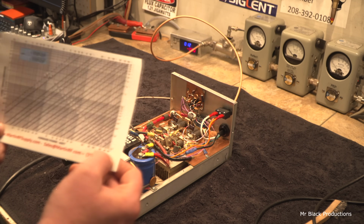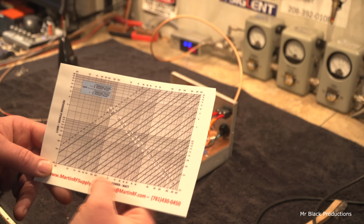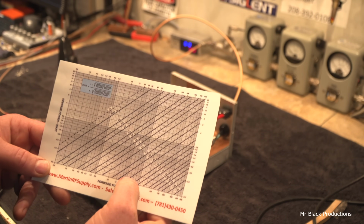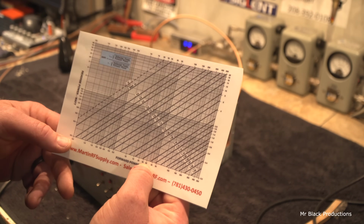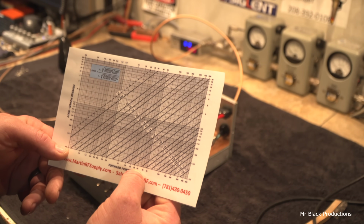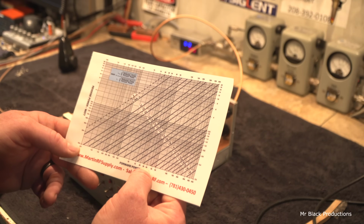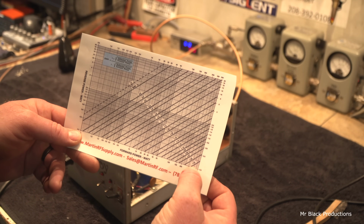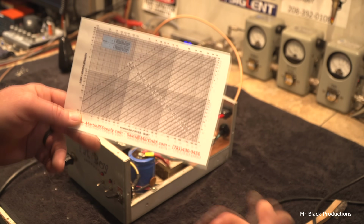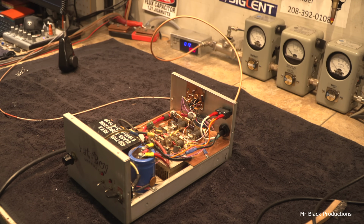So let's say my station with a 50,000 watt slug, and I'm putting, we'll say 35 kW out, or 30 kW out, which is the 30 mark here. And I have, what, 5 watts of reflect with 30K going out. That's down below the 0.02 mark. That's below the 1.05 number, just by adding some zeros. It's pretty cool.